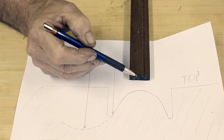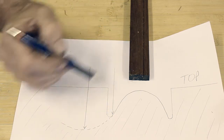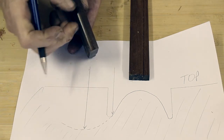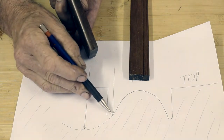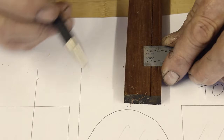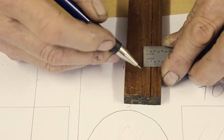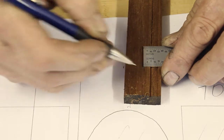What you can see now is we've formed our profile. Now I've got to find this spot and do my measurement for the next plane, which is my half-inch round plane. This is a half-inch round, so I want to measure exactly one quarter of an inch from there to the center line, then draw another cutting gauge line down through here. I'm going to put my quarter-inch mark just inside that sharp edge — which is the bottom of the profile I showed you on the piece of paper — and put a nice clear mark at the quarter of an inch.